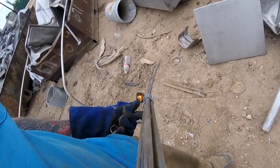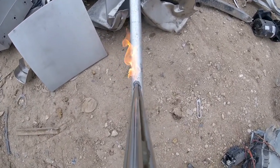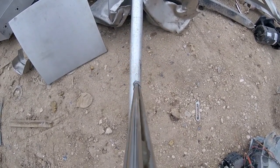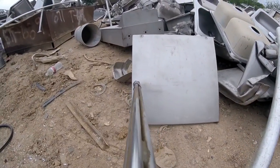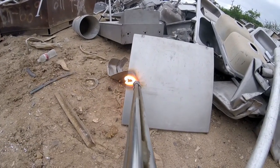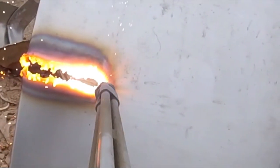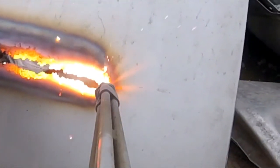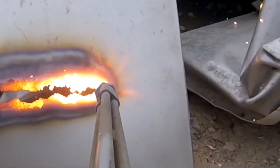This is the last method that I really have for you, and this is only if you have a torch — whether it be propane, acetylene, whatever. We try our best not to have to torch stuff because you're going to lose metal, but sometimes it's the fastest way to get screws off and cut it down to size so we can fit it in our baler. Right here, I'm cutting a piece of stainless. Normally I wouldn't cut this — it's just for educational purposes. You can see the way that it's cutting and the tint that it's making as it's being cut, the same type of tint as when they weld it because they're getting the stainless hot. You can see how the actual cut looks really flaky — it's edgy and flaky.